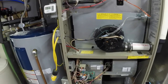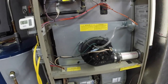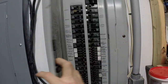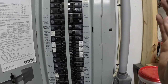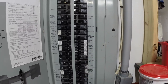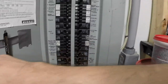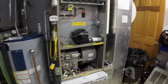First thing — if you're having a no-heat issue or your furnace is not running, make sure there's power to your furnace. If you haven't seen my video on how to check if a circuit breaker is tripped, you need to make sure your furnace has power. Come over to your electrical panel and make sure your furnace is getting power from the circuit breaker. Down here is a 20-amp breaker for my furnace — it is on. Make sure you have power, then you can come back over to the furnace.